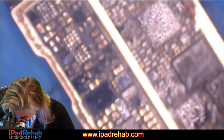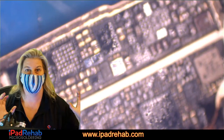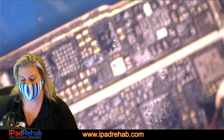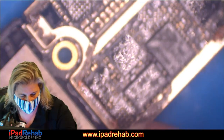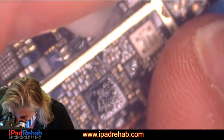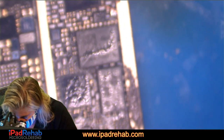So we're going to keep trying to eliminate variables. So another one is Tigris itself. So Tigris receives that battery input. It receives main, but it also has these other lines under there. So we're going to go ahead and just replace Tigris itself on this one to eliminate that variable, because it's kind of in this area where there's just a ton of possibilities where the water is going to cause a problem wherever the water went.